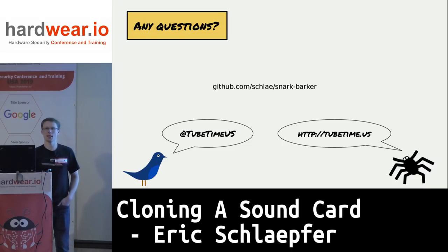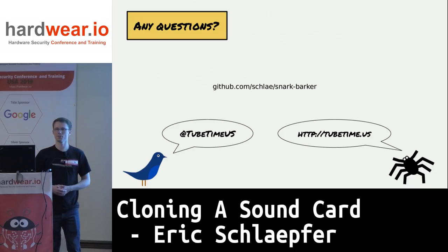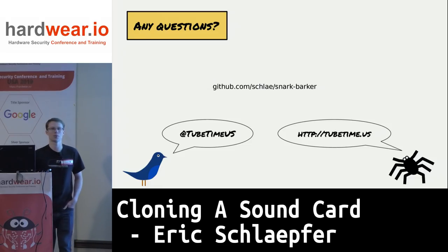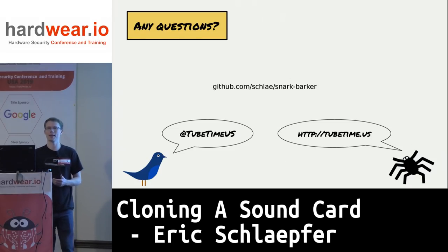Some of that has actually been reverse engineered before. If it's a microcontroller made by Philips, there's a known exploit where you use external address mode with an external EEPROM to dynamically manipulate the EA pin and do a MOVC instruction to grab the contents of the internal ROM and send them out through the serial port. One of the side goals of this project is to figure out a quick and easy way to dump code out of any protected 8051 — and that's one reason I'm so interested in that 512-byte test mode ROM.